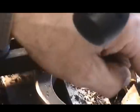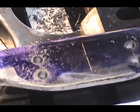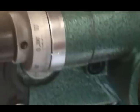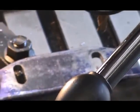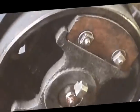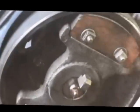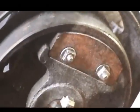And we have to continue this process for these slots over here, which will complete these slots here, so we'll have those 4 slots. As Jerry commented, those slots will be representing holding the wooden blocks into that spider after assembly. These are the bolt holes that we are making these slots for right now. The elongated slot is going to allow us, as the blocks wear down during operation of the machine, to put shims underneath the block to shim that width out, which will allow us to continue using those same blocks as the dimension changes for the fit up between the pulley and the spider.